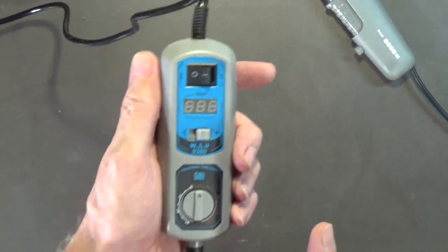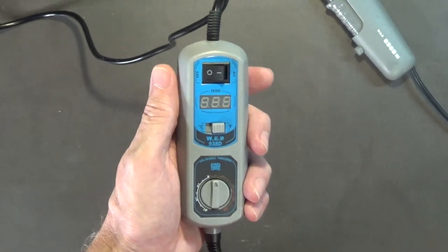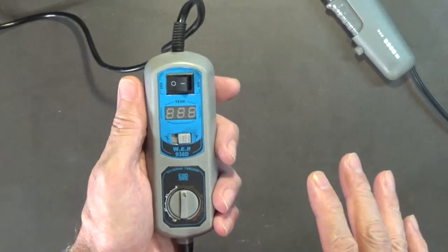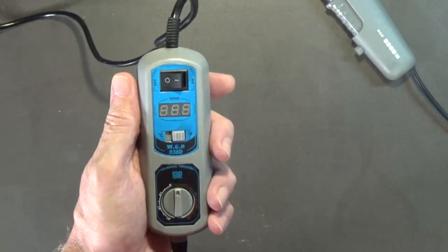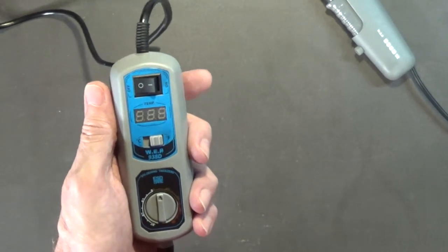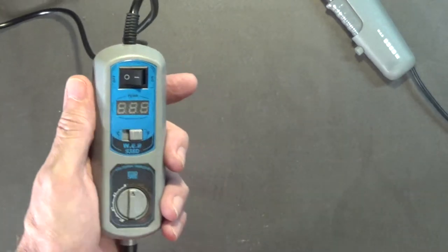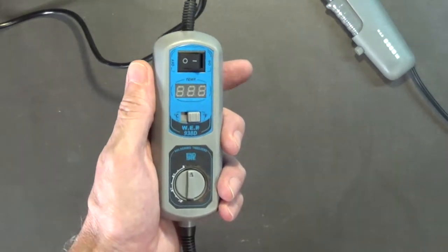Okay, like normal soldering iron tips, hot tweezer iron tips also have a maximum temperature rating, and you never want to exceed that rating, because the first time you do that, you might as well throw those tips in the garbage and install a new pair of tips, because you ruined them. Most soldering iron tips, in general, have a maximum rated temperature of 700 degrees Fahrenheit. Now, high temperature tips, which are special tips, can go up to either 800, 900, or all the way up to 1,000 degrees Fahrenheit. It just depends on the tips.